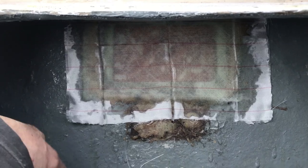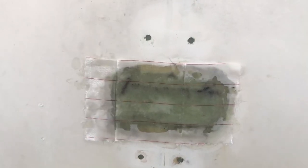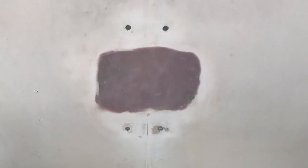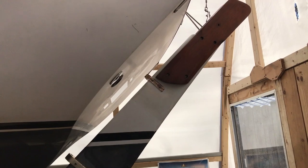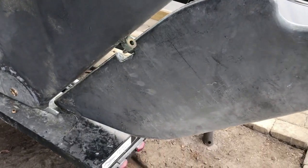I've now glassed it over, glassed over the exterior of the hull as well. Sanded down to knock down any high spots, faired and sanded, and applied a quick coat of unthickened epoxy. Installation of the rudder will basically be the reverse of taking it off - I just tied off the rudder head to the pushpit and propped up the bottom of the rudder onto the trailer.